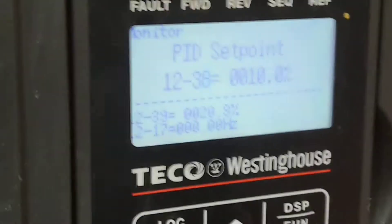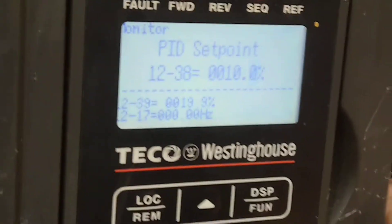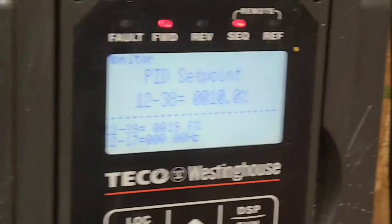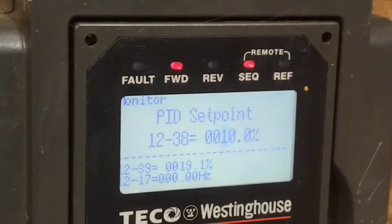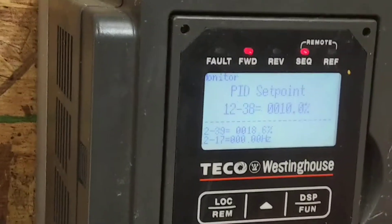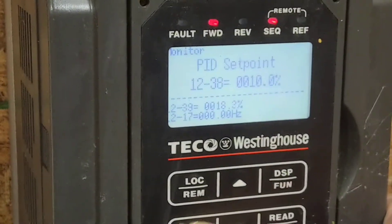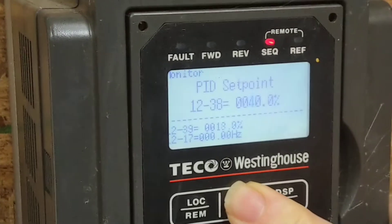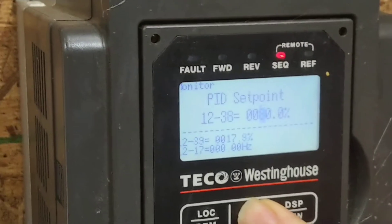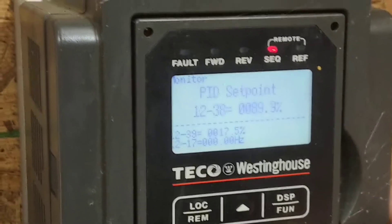So you want 100%? Is that how you make it control? No, like 90%. Last maple season we ran it at 90% and got 27 inches of vacuum. We'll never wash this thing out, though. 89% — read in.